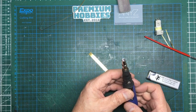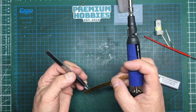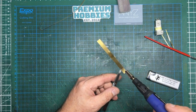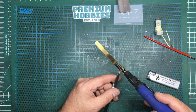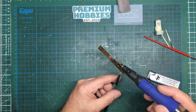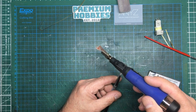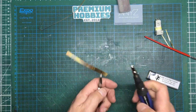We've got a little blow lamp going — let it get some heat into it. I'm going to hold this piece of brass in a pair of tweezers and I want this to happen quite slowly so you can see. What we want to do is get the colour to change to a kind of blue hue. You can see where I'm putting the heat — it's changing to a golden colour first, and then once it changes to a purple-blue that's what we're after. Some areas don't change as fast because there's dirt or debris on there. If you hold the heat on for too long it will glow red — and if it glows red, that's too hot.